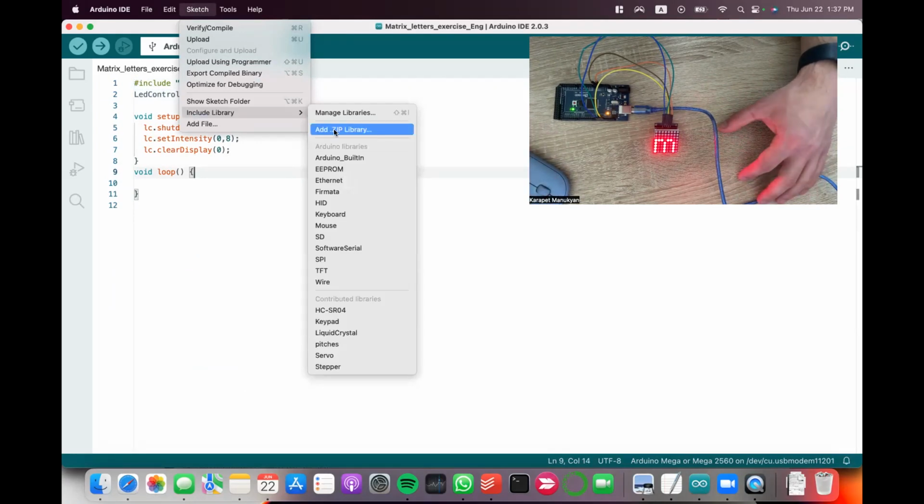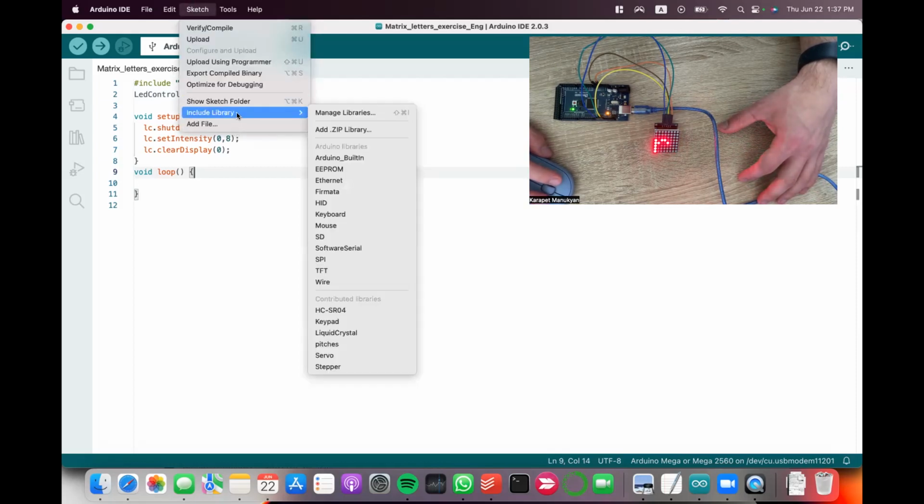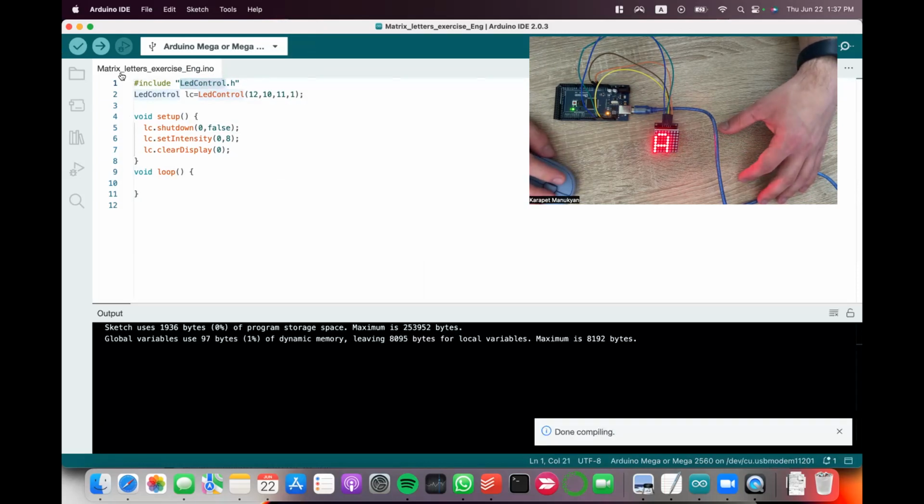I've already showed how to do this in our very first video about how to connect the breadboard. I'll leave the link in the description. They already did this in class too. I already have it in my computer. Sketch, include library, add .zip library. After this, they need to select the LedControl.zip. LedControl.zip is in the folder with all the codes and libraries that I already sent. In the folder that they downloaded with the book and the codes, there's a folder called libraries, and LedControl.zip is there. After they do this, let me compile.